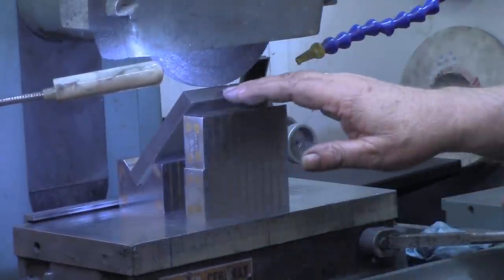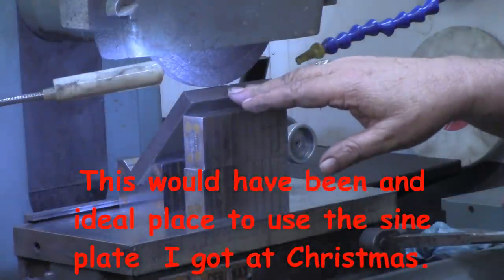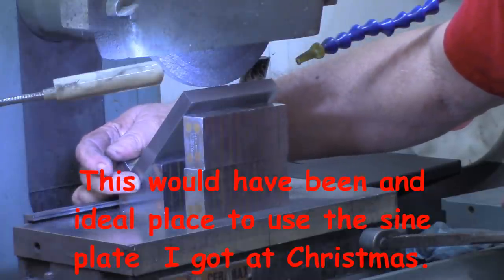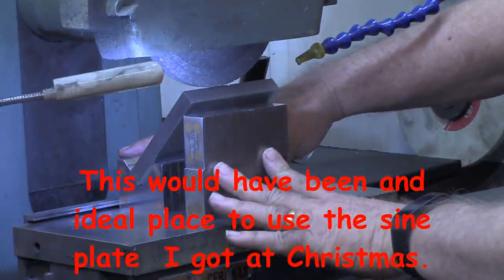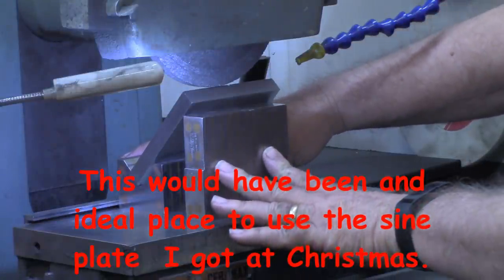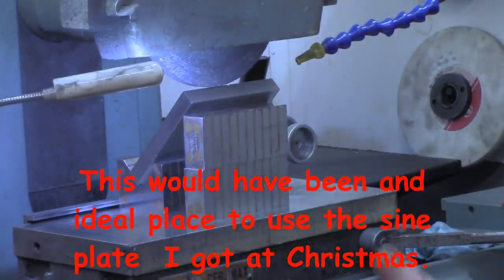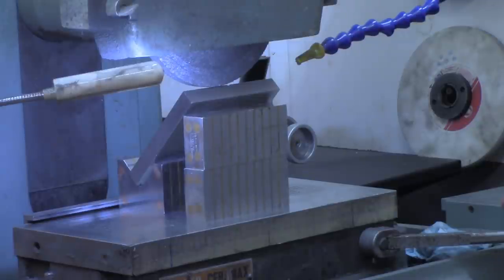All right, I've got them end ways in there now. They're sitting on the magnetic transfer blocks down here, 45 degree angle. Got them bedded in there. And these are just basically for support out here. There's a lot sticking out there. So we're gonna try and see if it'll hold. I've touched off, I've zeroed. So let's try going down 45 thousandths here.